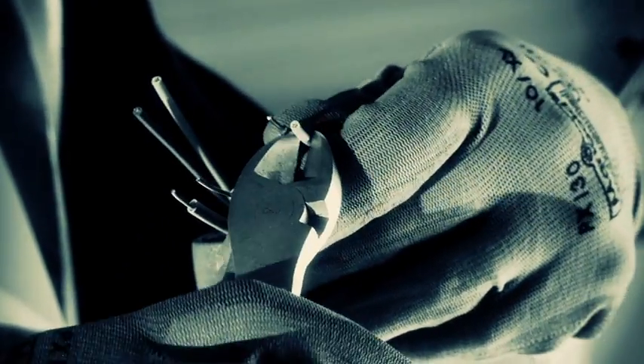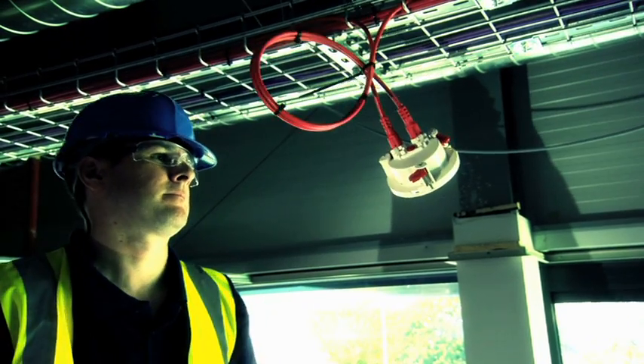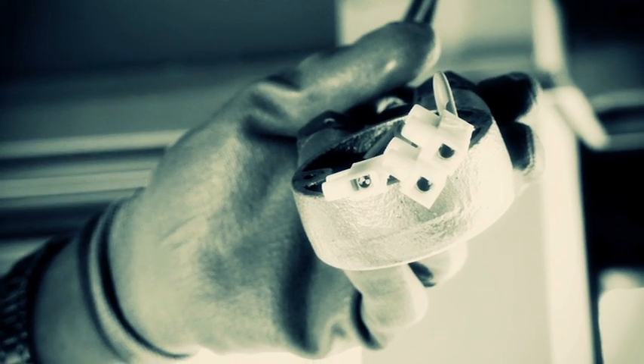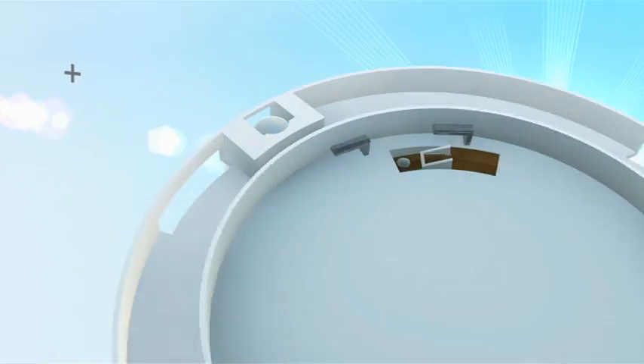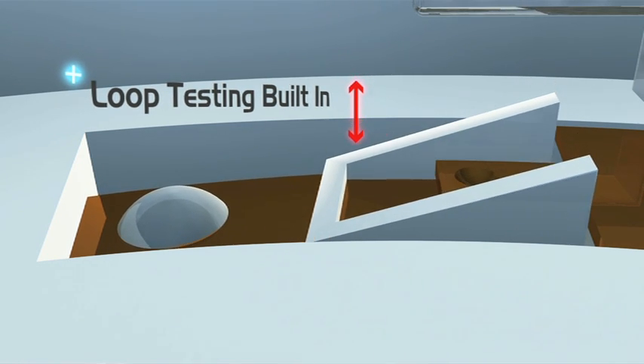As with the traditional system, once the cable is installed, any excess length can be taken up by forming a helix. When compared to using the traditional method of connector blocks to facilitate cable testing, Plug and Play offers an impressive alternative in a fraction of the time by simplifying loop testing.